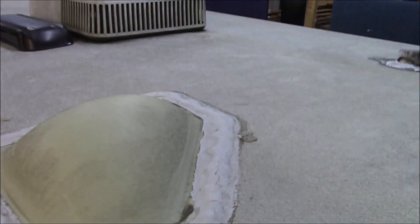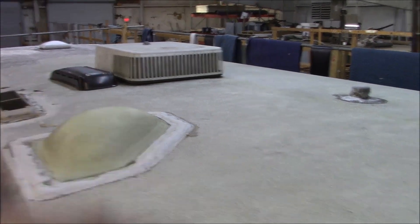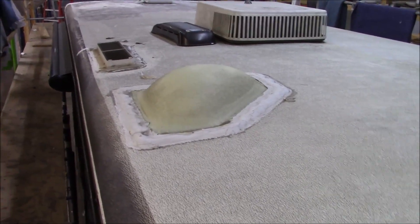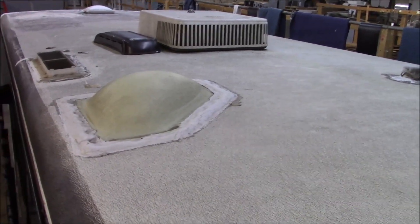I'm still not a fan of this acrylic stuff, but if it was glued down well and we were confident there were no issues underneath, we would just keep rolling with it. We're going to bring the roofing right over the sides, take the gutter off, and the roofing will go right behind there. Overall it doesn't look like a lot of sagging. We've found sagging on air conditioners before, but right now it looks pretty good. We've got a reported leak in the front bunk on this side, so we'll explore that — hopefully just a caulking issue.